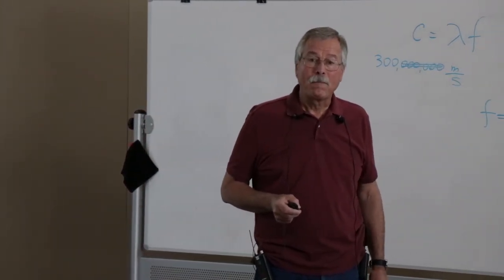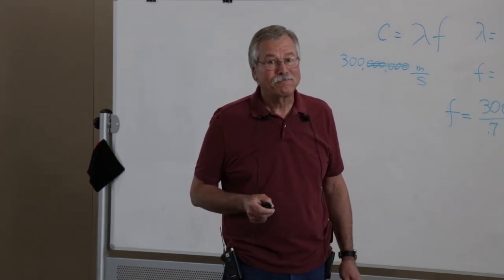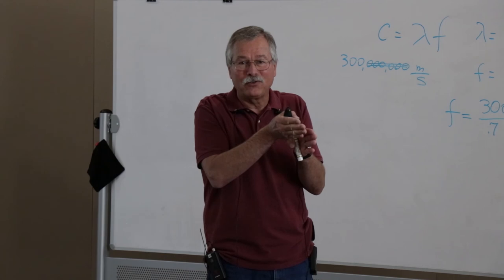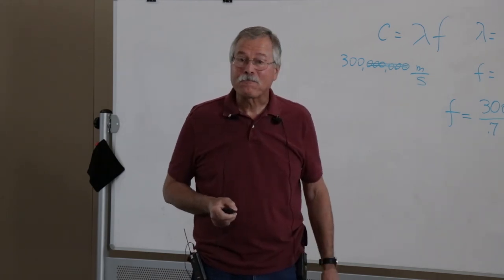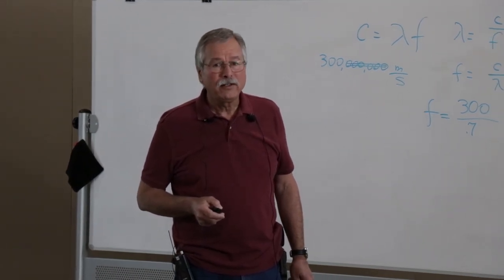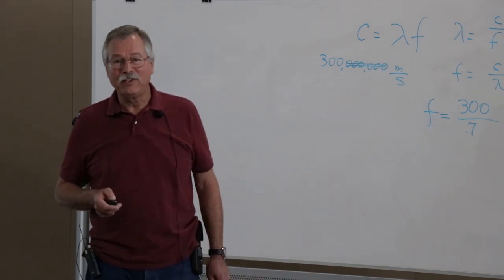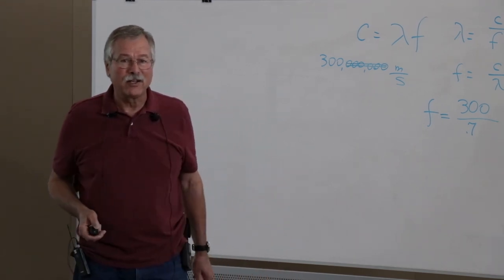How come most of our handheld radios do not have sideband, do they? Oh, they do. That's why we cannot put your conversation right next to another conversation just a few hertz away. You're given 15 kilohertz. You can't regulate just upper sideband or lower sideband, right? On a handheld, when you say regulate it, you can choose. We'll talk about that. But yes, you can choose to use just one sideband or the other, but it takes more circuitry inside the radio to do that.